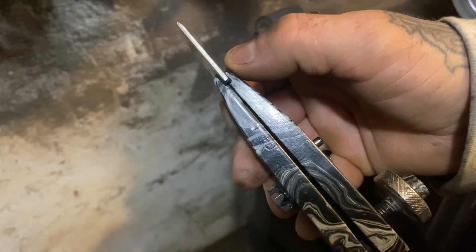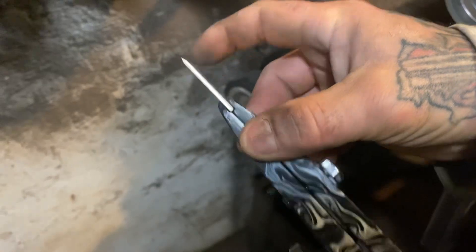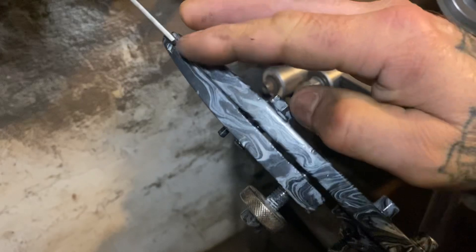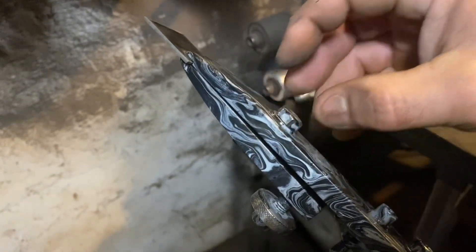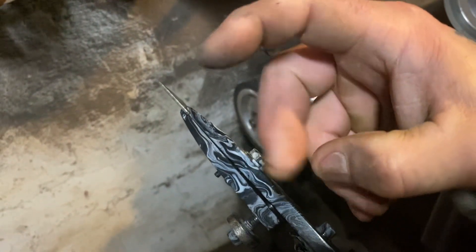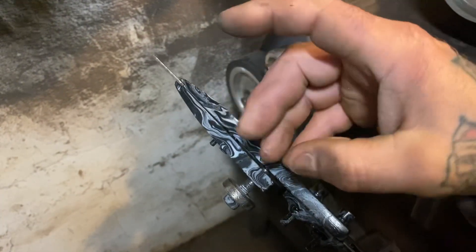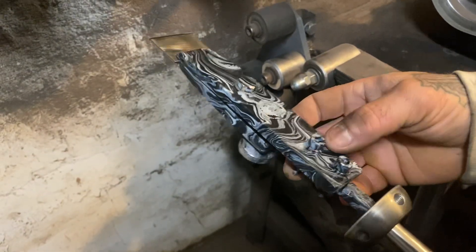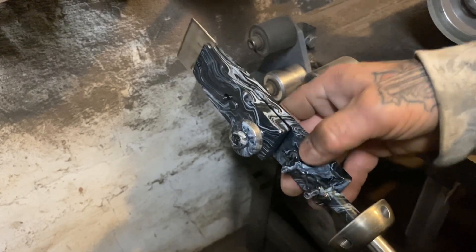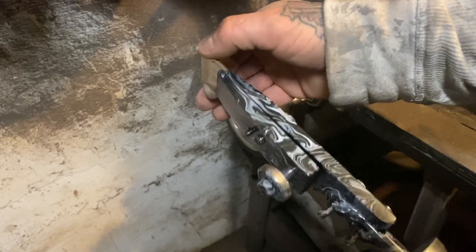At the very tip of the teeth I've got some sticky foam in there — it's stuck to it so it doesn't scratch, and it's really firm and tight. You can see it's wider here and close there. You can adjust this nut in and out for wider knives. You undo these and put your shims inside here and clamp it to the size of the knife, and then you'll get a perfect edge every time.